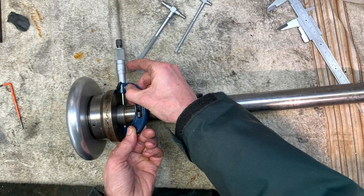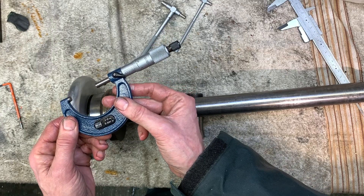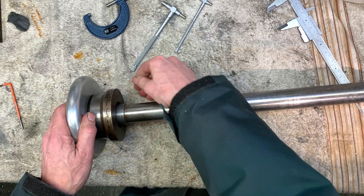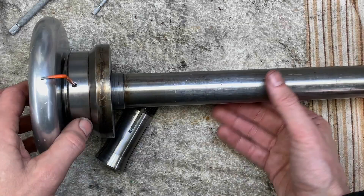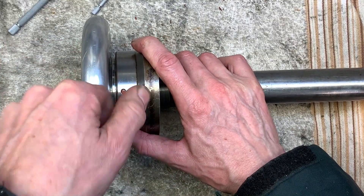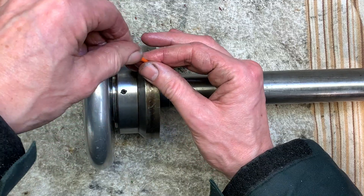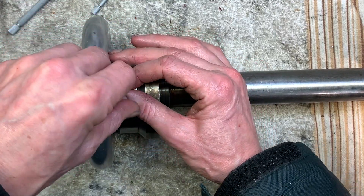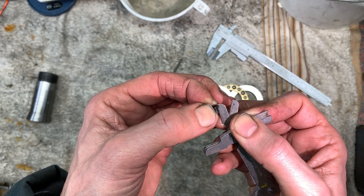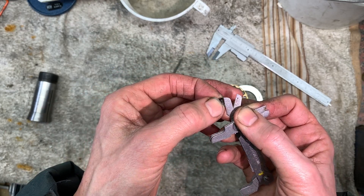That wider part would match to the bore of your spindle — that's 1502, 1503, something like that. I'll just see what's going on in here. Take this grub screw out. The little grub screws are 3/16th 32, so it's 3/16th BSF.